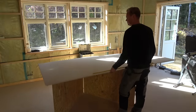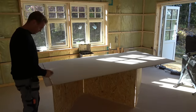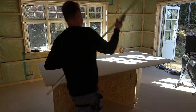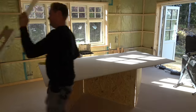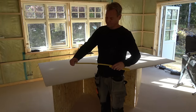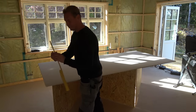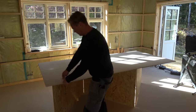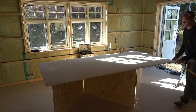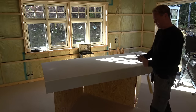Let me show you how carpenters cut drywall. There are different ways, but this way is faster. You can use a straight object to cut the drywall to size, but it's slow, and you need an extra tool. Instead, we press the knife against the folding rule, and measure the correct dimensions and cut directly, like this. It takes a while to learn, but once you get the hang of it, you will use this method, both when drawing and cutting.